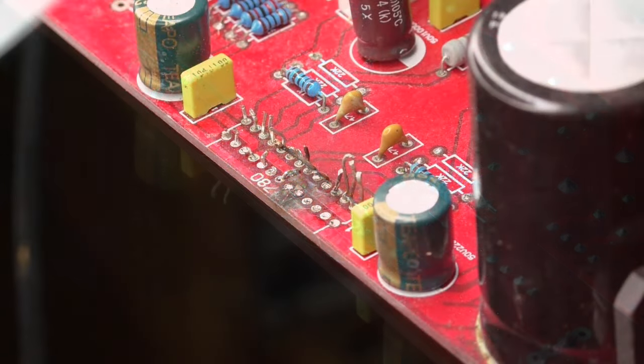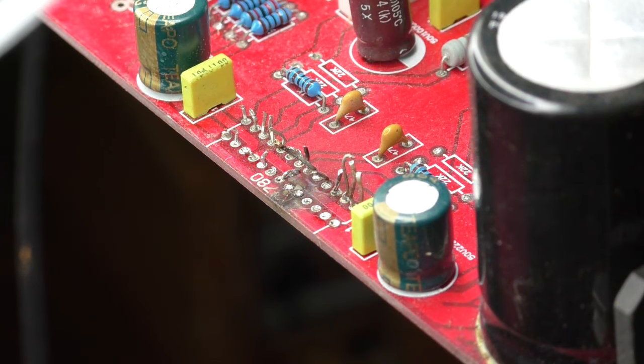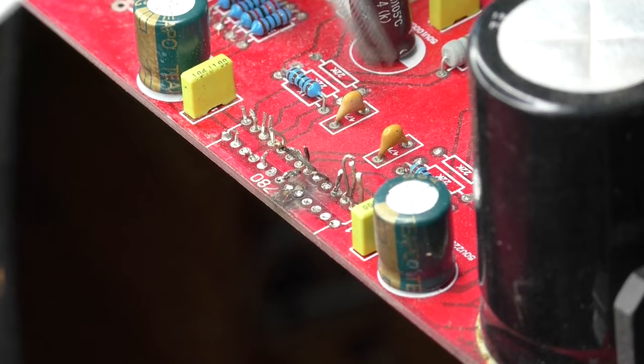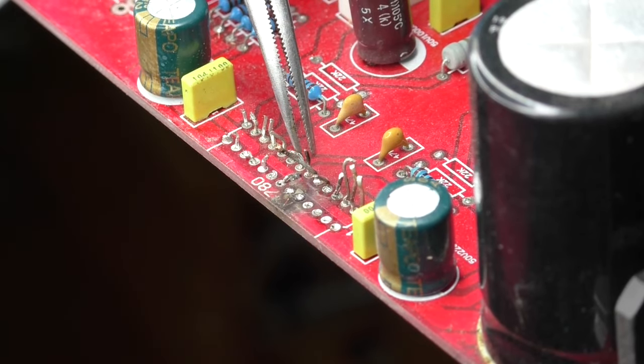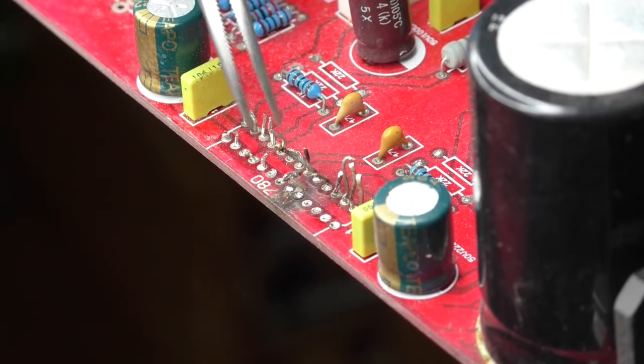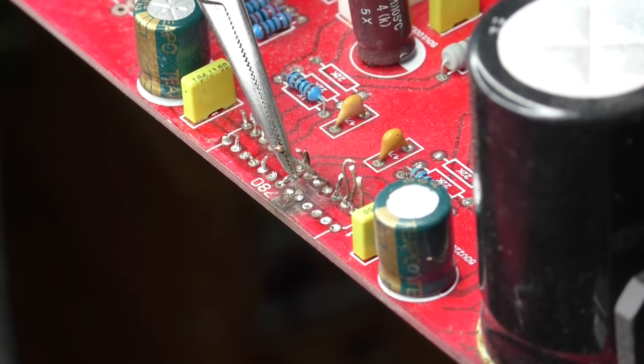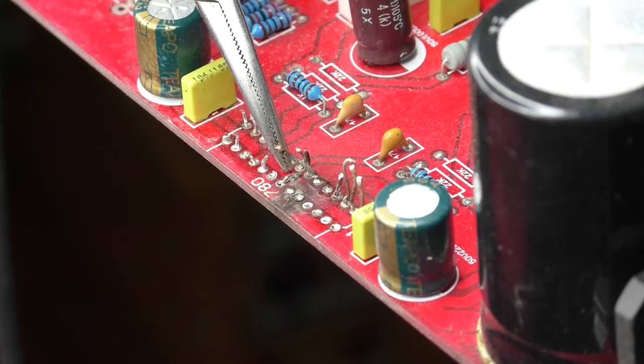Flipping the board over to work on the inner row, I found that one of the leads was bent over and manually soldered to a trace on the board. Apparently, the manufacturer of this PC board forgot to connect that pad to the trace, and this was a hack to resolve that error. You will see later that I resolved this error with a different method.